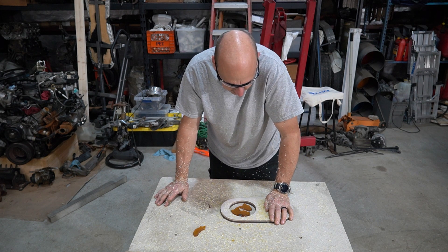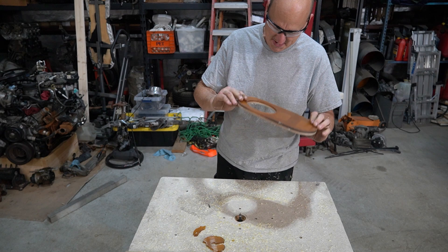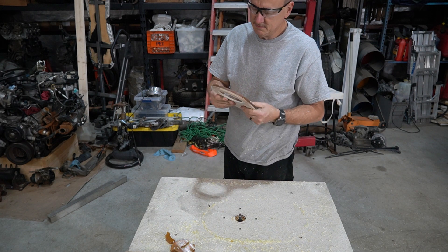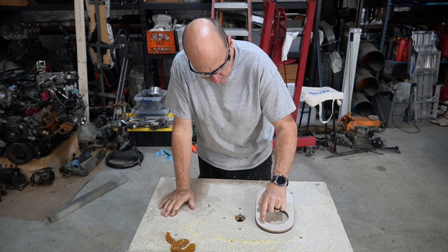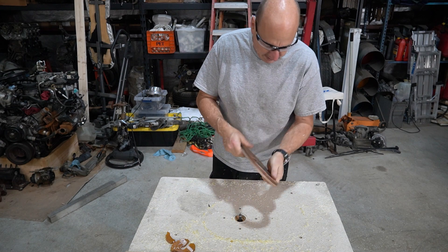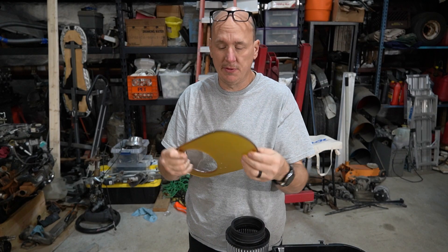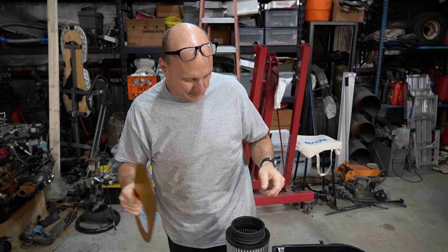Good thing I had my safety goggles on — could have got me in the eye. But that was fun. Let me go ahead and fire it back up and clean this hole up a little bit. That's going to work out swimmingly. I still have to put a rabbet in that hole because I want the filter to actually sit a little bit into this material — it is five-sixteenths of an inch thick. I'll go ahead and rabbet that out and then we'll test fit it on the truck. I also took a round-over bit and went around the whole thing so that it's nice and smooth with no sharp edges — not super necessary, but it makes for a nicer piece.